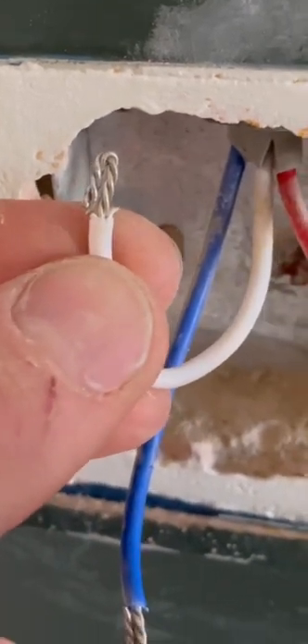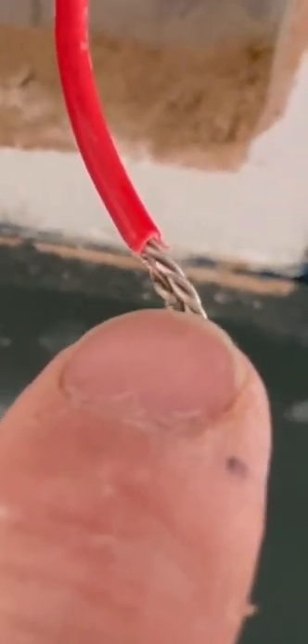You can tell it's copper if you look here where I've twisted the cable up and then doubled it back — it has exposed just a little of the tinning, and you can see the copper underneath. So don't necessarily just assume it's aluminium.